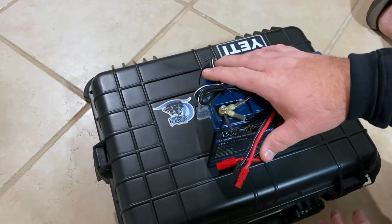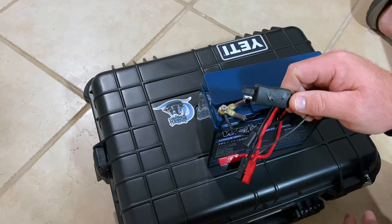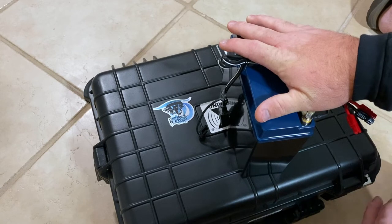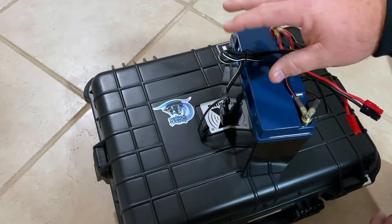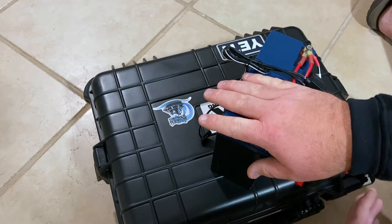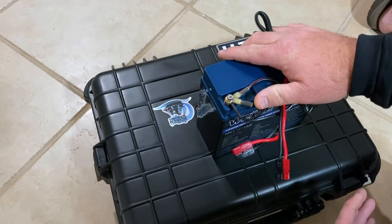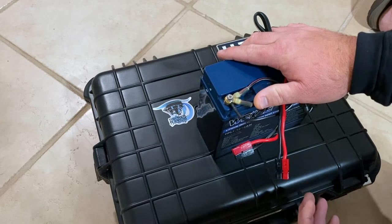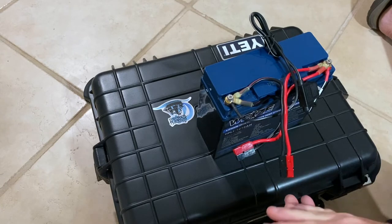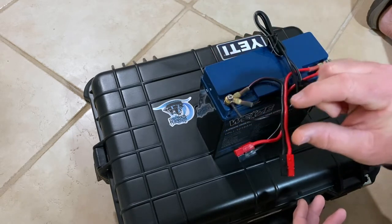On top of the battery I have a charge controller with a blinking green light so I know when I'm getting to the 'I need to stop' part. I picked this battery because it's cheaper — not one of the bio batteries — but it does have onboard balancing built into the top cap and voltage regulators built in, so you can't actually kill it. The life cycle is two to three thousand charges, and with a lithium phosphate battery that means two to three thousand 100% charges — so charging from 50% to full only counts as half a cycle.